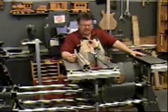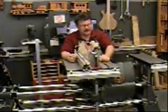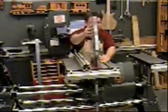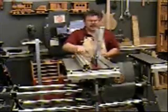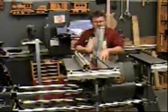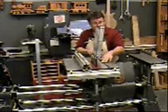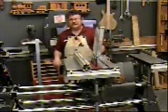When you're using the Mark V in saw mode, it's important that the miter gauge slots be absolutely, positively parallel to the rotation of the saw blade. Everything depends on this. If you guide a piece of wood against the fence, the fence is set up parallel to the slot, so it's got to be parallel to the blade. If you're using the miter gauge or a sled to feed the wood, the miter gauge, of course, follows the slot. The slot's got to be parallel to the blade.